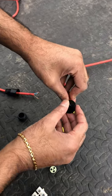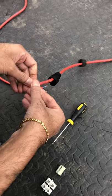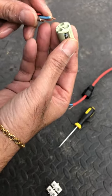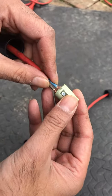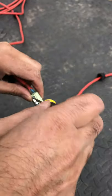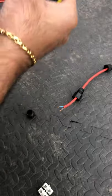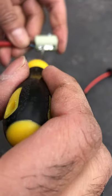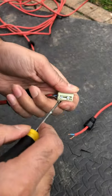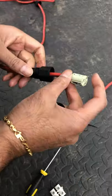I'm just going to do the same on the other side — put that through there and do the same on this one. So I've got the junction box there and we've got the neutral which is the blue wire and the live which is the brown wire. We're just going to put them both in at the same time, hold them in so they're quite snug, and then tighten the screws. Make sure they're tight and get that nice and snug like that.